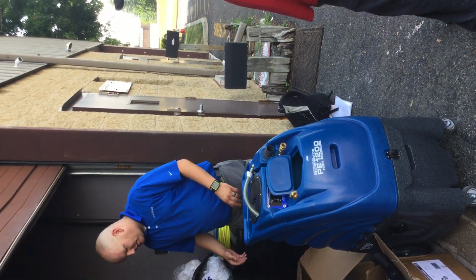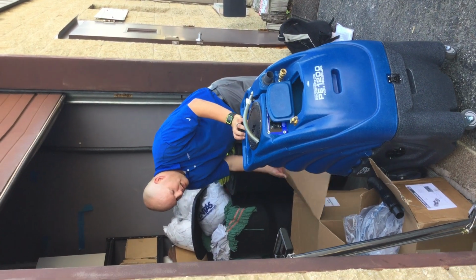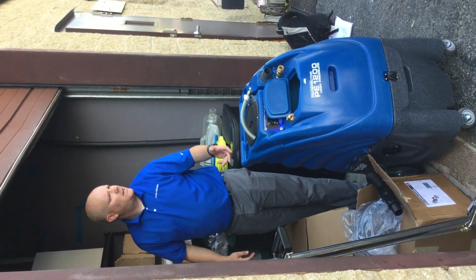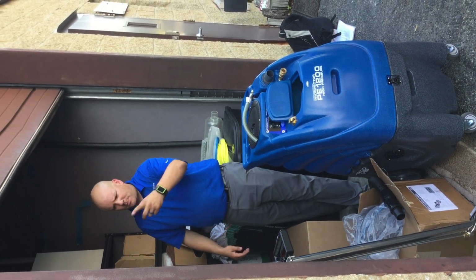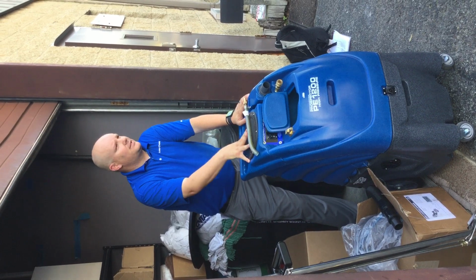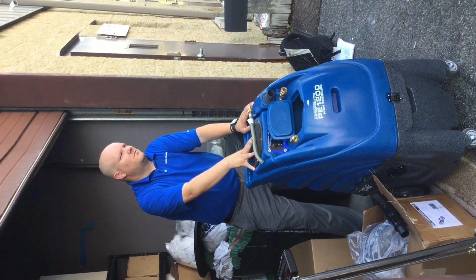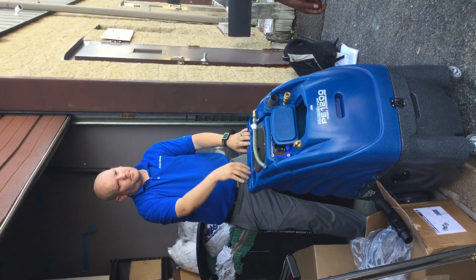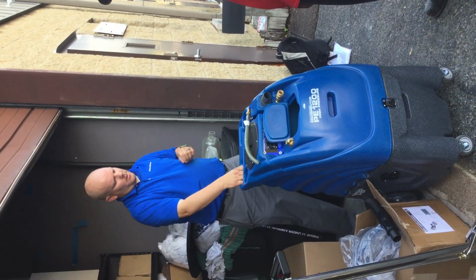I think that's it. But the big thing is, remember, grout level, pre-spray, not in the machine. Let it sit for 7 minutes. Hit it with a grout wand if you want to kind of speed it up. And then go after it with the spinner. The spinner will pull it all through, autofill, auto dump. Because if you don't autofill, auto dump, you'll run out of this 12.5 gallon tank in about 5 minutes. And you're only using autofill, auto dump, not on carpet. You don't need it on carpet.